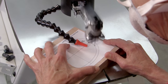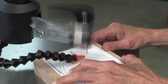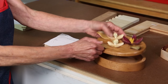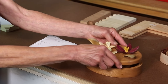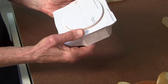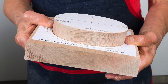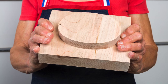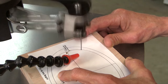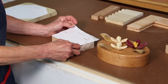Once the blade is properly installed, it should cut accurately without bowing or distortion. I gave the jet a pretty rigorous test, seeing how well it cut solid ovals from one-and-a-quarter inch thick maple and oak. This kind of cut is often the first step in making typical scrolled boxes like this. I wanted to see whether the centerpiece would slide out freely from the top or the bottom — when a piece does that, when you can pick it up and it'll just drop right out, you know you've made a true vertical cut. Although technique has something to do with it, even the best technique won't compensate for a really inferior saw, and I was pleased to find that the jet handled this task, as well as less demanding cutting tasks, easily giving good quality cuts.